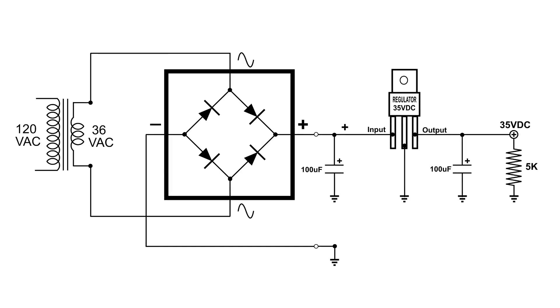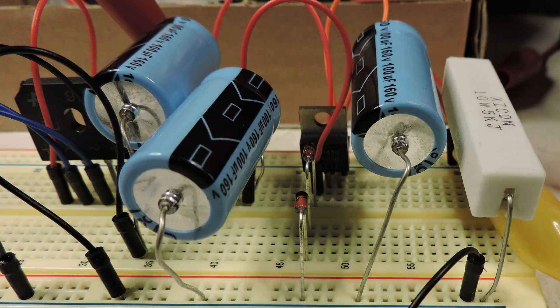This is where we left off from the last video, putting in a regulator at 35 volts. I'm going to change that to 36 volts, and the reason is right here. You see two zener diodes there. I was thinking about using three 10-volt diodes and a 5-volt diode all in series to give me 35 volts, but that's pretty crowded on the breadboard. Two 18-volt zener diodes give me 36 volts, and I thought that was much easier to follow.